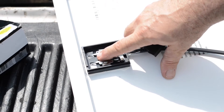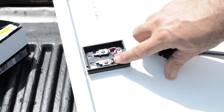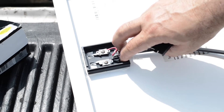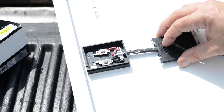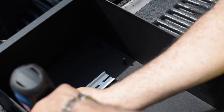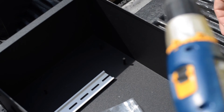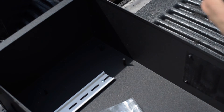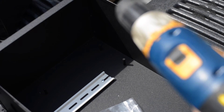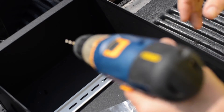One thing we get called about: it's very hard to see where the positive and negative are imprinted into the plastic, but you can see there's a positive and a negative. Respect polarity when you're wiring it up — bring the wire in, crimp it down so it doesn't move, and secure the wires underneath the terminals. Now we're on to the control box. I'm going to mount the DIN rail, which will give us the mounting for all of our controls, using the provided self-drilling screws. Then we want to drill some holes in the box so we can mount the box to our wood post — I'm going to use a 3/16-inch bit, but use what corresponds to the mounting hardware that you provide.